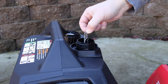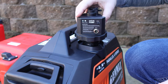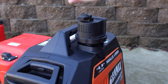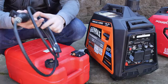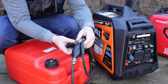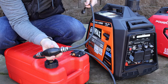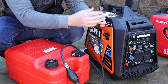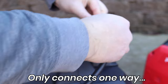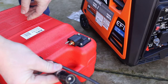Don't worry — there is a strainer on the external fuel tank, so you won't really need the internal one anymore. The chain will just drop inside; that's not going to do anything and you can retrieve it if you need to. Now take your fuel pump, slide it in, and thread it on. It is kind of facing backwards — it'd be nice if that were adjustable, but it's not that big of a deal. When hooking up your fuel line, it's basically the same thing as on a boat with an outboard. There's a little arrow on your primer bulb — that arrow faces towards the engine, or the generator in this case. Take this connection and put it up on the fuel pump.